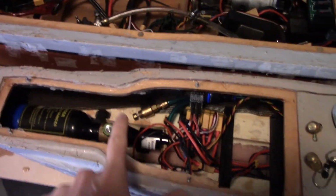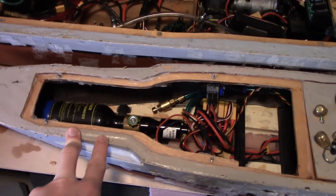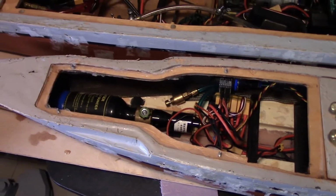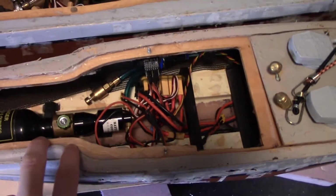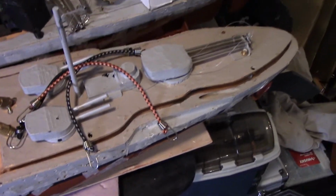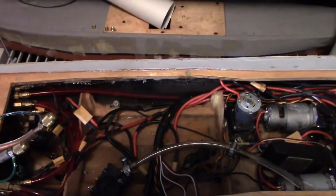In general, the subdeck would be thicker than the actual deck pieces, so for the rules you're limited up to 3/8 inch thick at the top edge of the hull of impenetrable area. So typically you'll see a 1/4 inch subdeck and then a 1/8 inch thick deck. Alternatively, like on this boat, I think the subdeck and the deck rim are both 3/16, but the deck pieces are only 1/8, and then I have a silicone compound that provides that extra 1/16 of thickness and provides a good sealing surface. The Missouri here is more traditional with the 1/4 inch and the 1/8 inch.